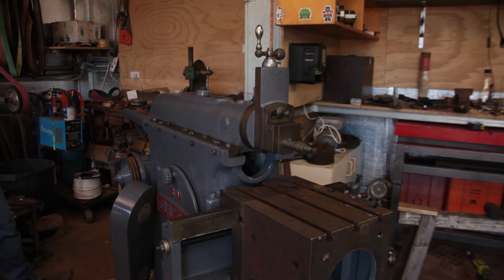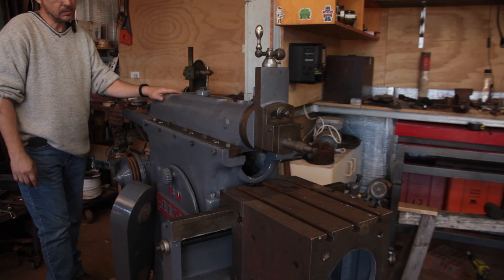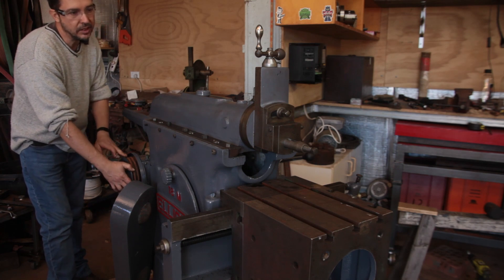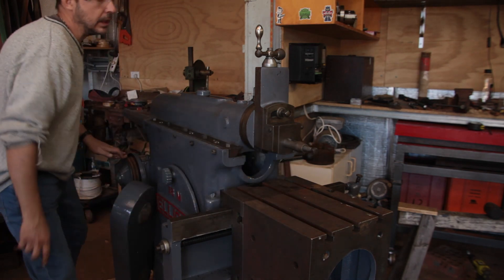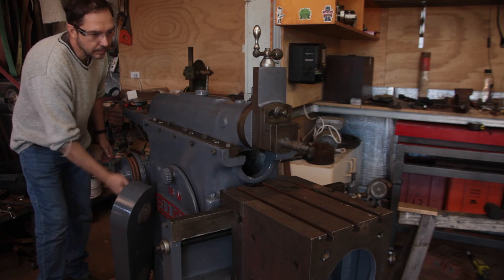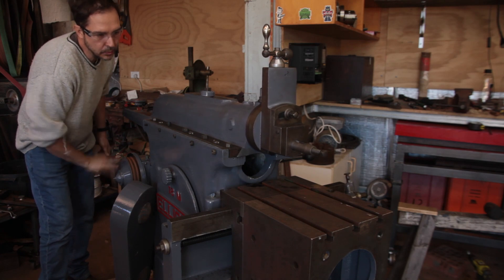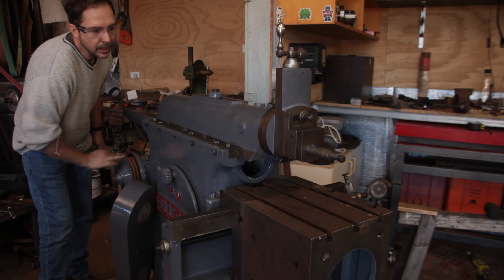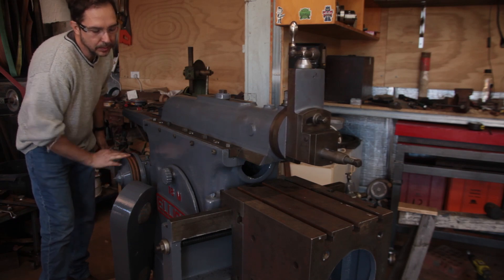Given that we haven't got electrics or all the belts hooked up to the motor, I'm going to crank it by hand. You guys get to watch the ram do its thing. There's no work piece on the table, so the clapper isn't going to do any clapping, but suffice to say it moves freely. Slow-ish forwards, and as with all of these machines, it's got a rapid return. Probably got a bit too much oil on it, but seeing as I won't be doing much with this for a few weeks, it's probably going to be okay.